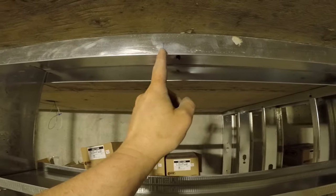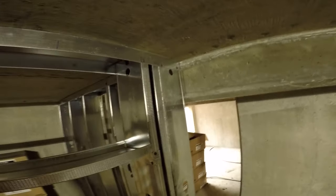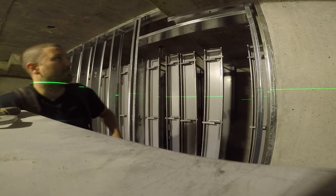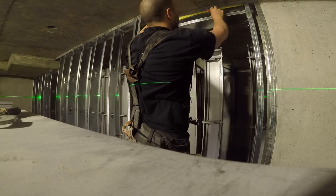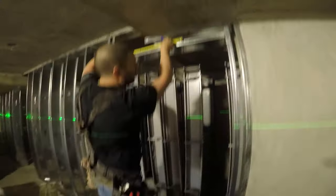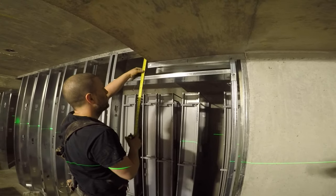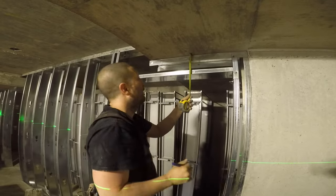For the centers, all I'm going to do is measure from here to here and it'll be the same because the studs are plumb. I can measure from the back or what not — simple as that. Then measure across because these are plumb, just measure across. Measurements: 11 and 5 eighths, 9 and 5 eighths, 16, 15 and 3 quarters, 5 and a half.